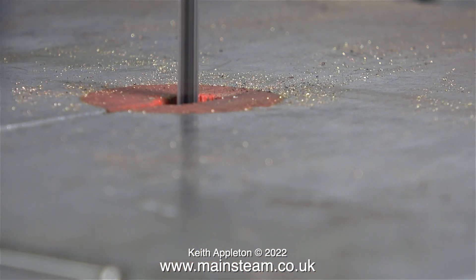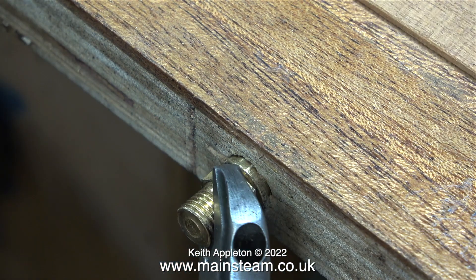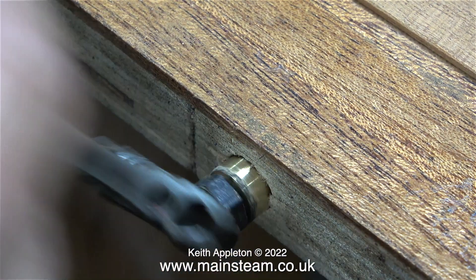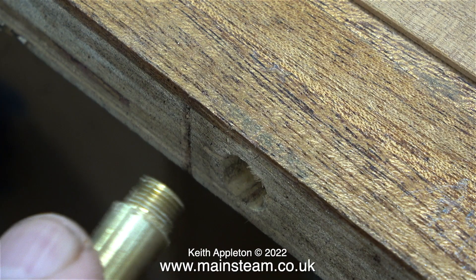I'm not going to show the cutting process — I did this in a previous video. I think it's about time I mention this special fitting. This is the drain pipe from the sump that sits in the baseboard. I need to drill a hole in one of the mahogany side pieces to accurately line up with this fitting. The pipe screws into the silver soldered sump, and what I'm doing here is unscrewing it. No sooner was that done, I coated this end of the thread with Loctite 603 and bolted the whole assembly back in position.